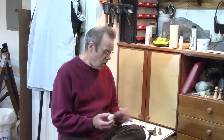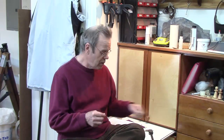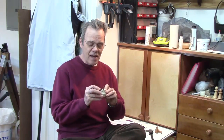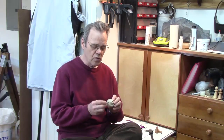Let's talk briefly about that failure of the screw chuck. The root cause is that after I turned the rooks, I started making the holes a little bit deeper in the bottom, anticipating the need for some additional weight — lead, pennies, what have you. I didn't make any adjustments on the screw chuck, and by increasing that depth I shortened the amount of hole on the two-inch screw. The CA glue quick fix worked fine for that one time, but ultimately the best solution was replacing the shorter screw with one about a quarter of an inch longer, and that solved the problem going forward.